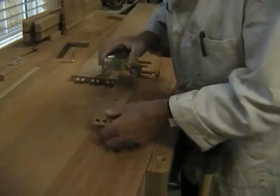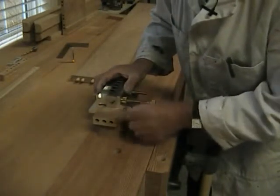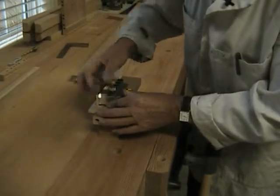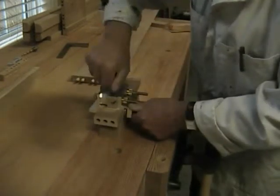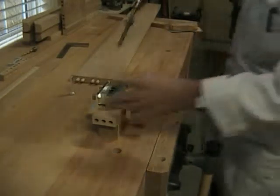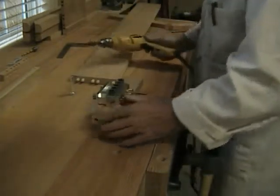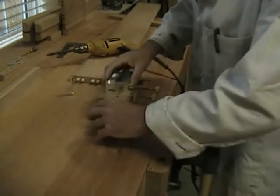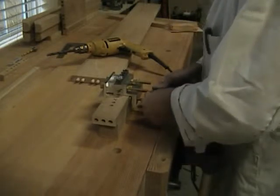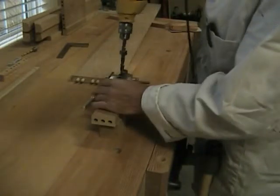We go to the check marks — there's a check mark here, so we use this check mark to that surface and bring this check mark up to the line. The line is exactly where your wood will finish up. Make sure we get this back in exactly the same position, drill them all, move it along into the last bore, tighten your clamp screws, skip one hole that's been indexed, and do another two holes.